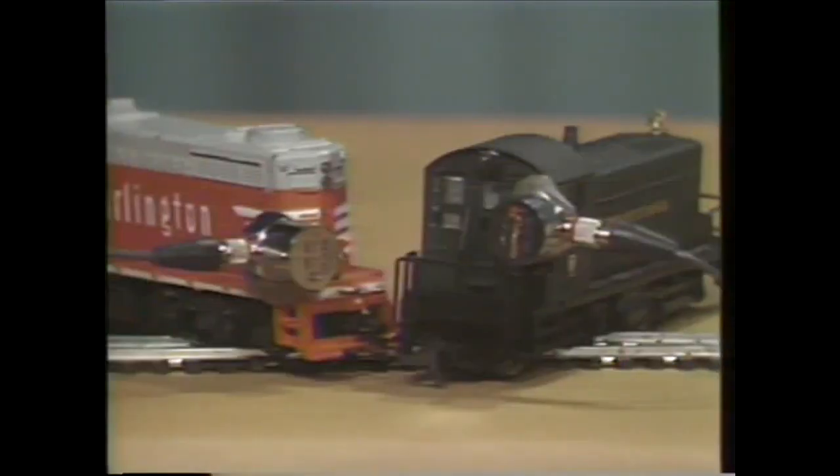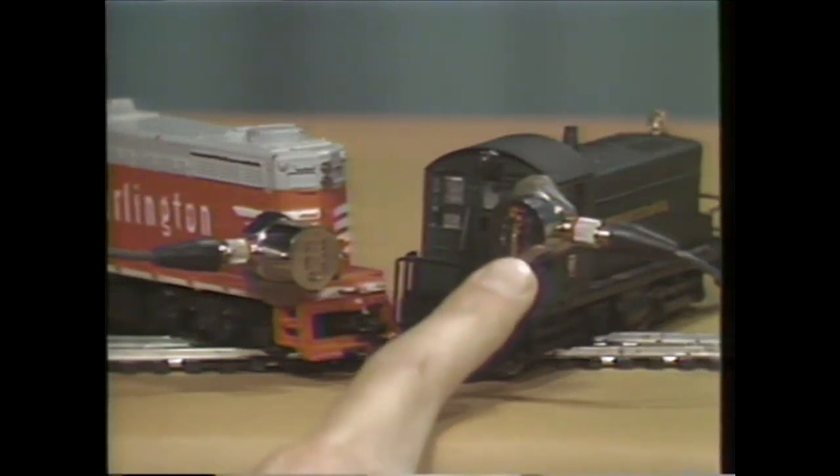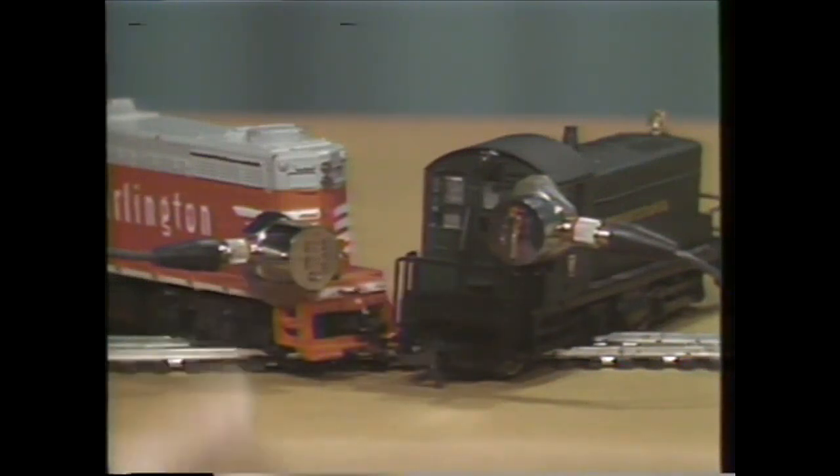At the beginning of this tape, we started a destructive test with two model trains. Collision testing is a fundamental procedure to determine the structural integrity of various types of machines and vehicles. To measure the internal forces and energy exerted or absorbed during collision, transducers are attached to the colliding vehicles. For our model train example, accelerometers have been attached to rail cars on both trains. When the two trains collide, the instantaneous deceleration will be recorded by the 5223.